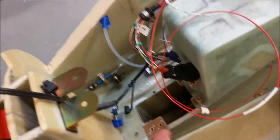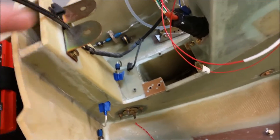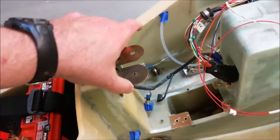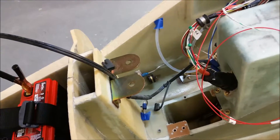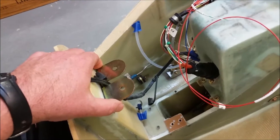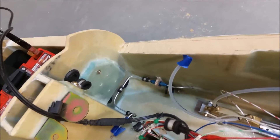You can see the NG30 cover — I don't have the front cover on here, but you can see the mounting plate for the parking brake. I need to clean this up a little bit. Right here are the two clear reservoirs for the brake fluid. I do have the right rudder/brake pedal installed, and you can see the mount pad right here for the battery bus and the battery bus relay.